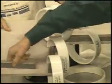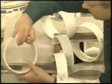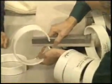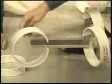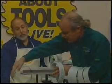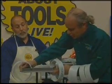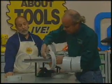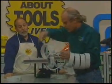And then this corner, it's the same thing as you would apply it. You put it on, you wiggle it, you put it where you want it. Now, a lot of fabricators have problems with voids in their corners. If you have a void with Danny clamps, you push down on the clamp. It will push this workpiece forward, and you push in on the bottom of this, and it will actually push your corners together.